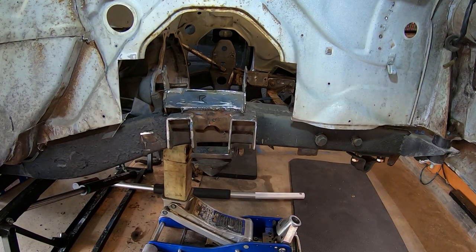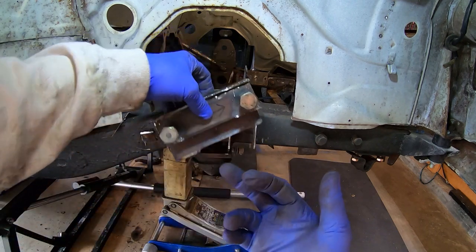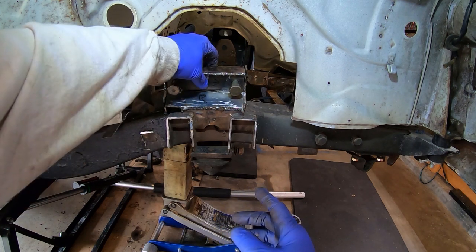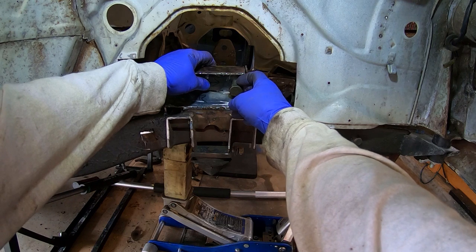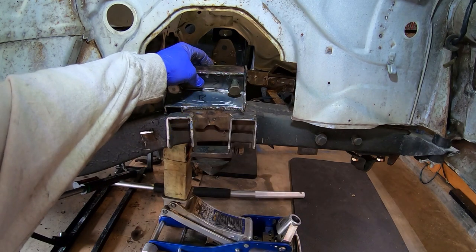After I remodeled the frame and double-checked everything, I was at 89 degrees — not 90 anymore somehow. I also noticed the truck isn't perfectly level zero from side to side anymore. So I did something I didn't want to do: I cut this plate out. The original frame is right here and the original frame was on the inside. I put that nutsert plate on the outside, but really it needs to go in more — I need just a little bit more; it was barely zero degrees sometimes. What I want to do is push it back enough to have factory shims — almost three millimeters, which is about an eighth of an inch, the thickness of the frame.